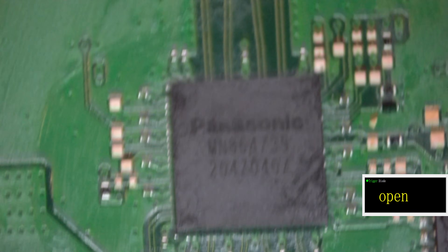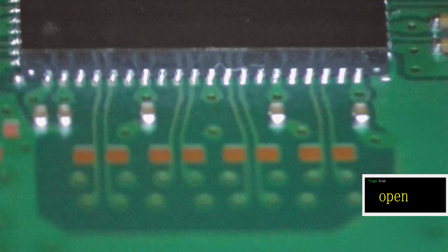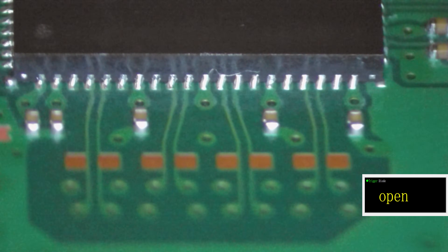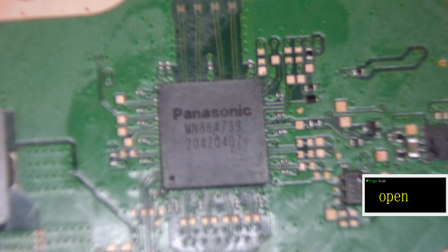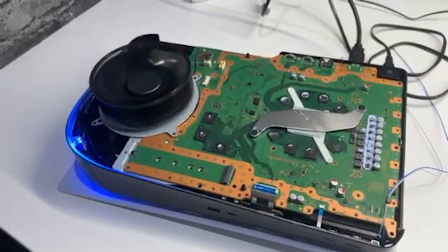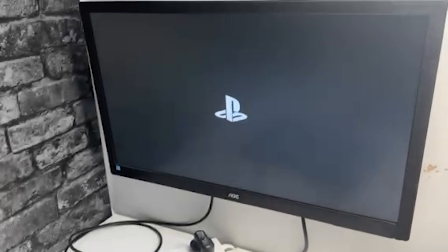As you can see, the alignment is pretty goddamn good. It probably could do with moving maybe a micro-millimetre across to the left, but all of the pins are connected. Using solder paste I just find it's a bit of a quicker and easier job to get the chip aligned. So I'll finish up cleaning the whole area and then we'll give it a test. Just temporarily put back together for testing. Let's push the power button — here we go — blue light. Do we get any video output? Yes, we do! Fixed.